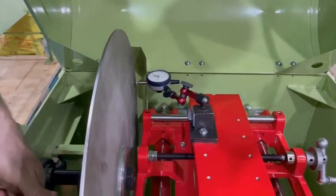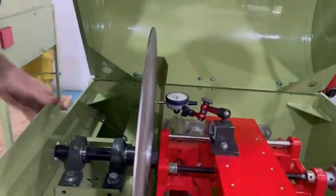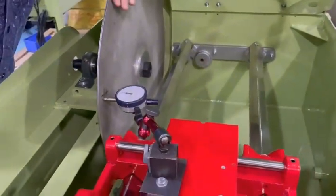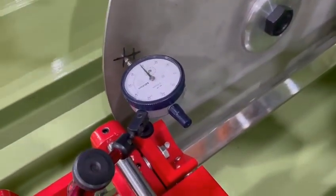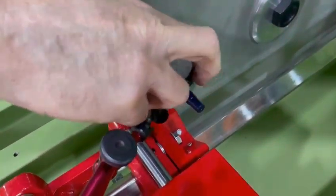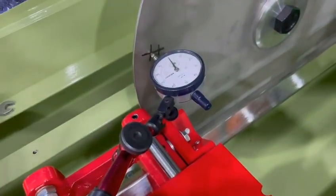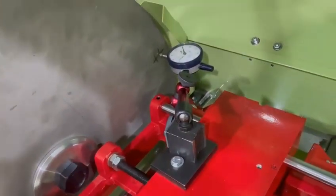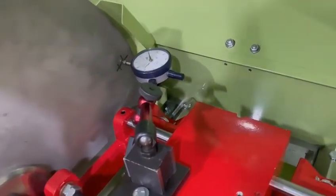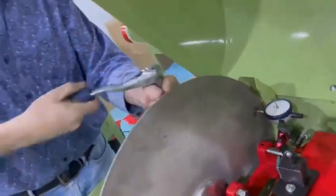I'm pushing front, pushing back, and I'm on 80. Now I'm going to come back and get on the zero here — it's on 70. That's good news, because if I'm on 80 at the back and 70 at the front, it means I'm only 10 off. I'm going to check my work, re-zero, and come back here. I'm 10 off — so I'm 10 high right now. When I'm that close, I want to tighten these bearings. This is going to move me some, but I know I'm within 10.